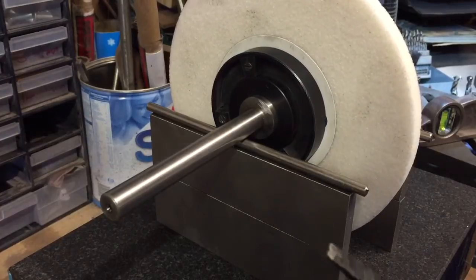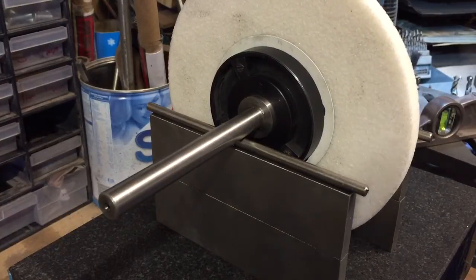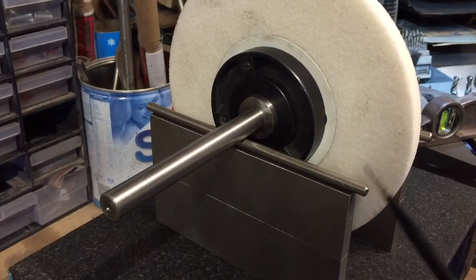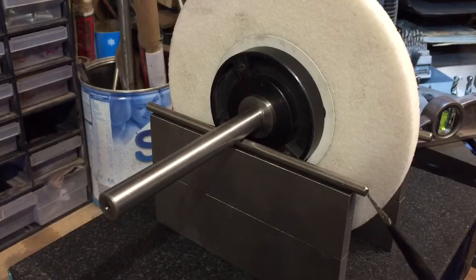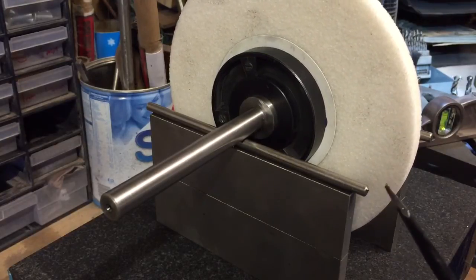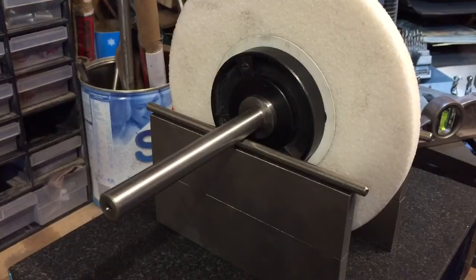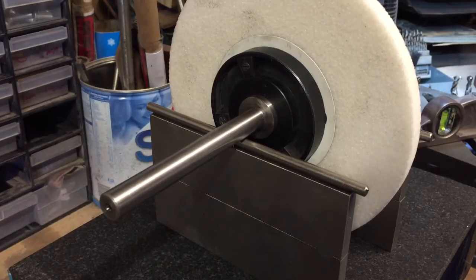So if you have got a surface grinder and you think, oh my god, 300 quid just to balance them wheels out. If you've got a surface plate, some parallels, precision ground drill rod or precision ground round stock, level your surface plate, pop them on there, do what I've just said, adjust your counterbalance weights, and you'll have a surface grinding wheel that's running really true. You should get a better finish then. I hope that helps somebody who's got an old surface grinder who's maybe struggling.